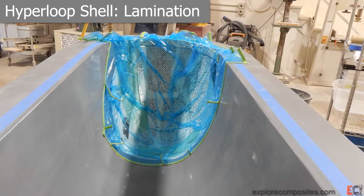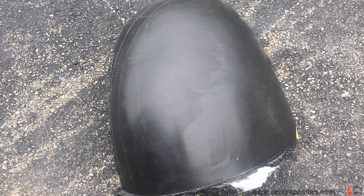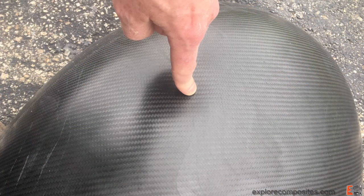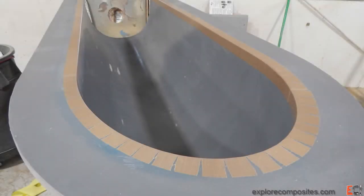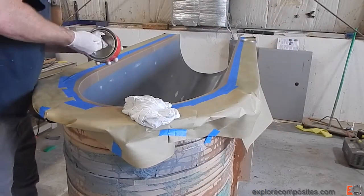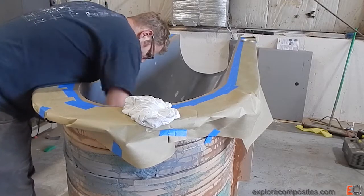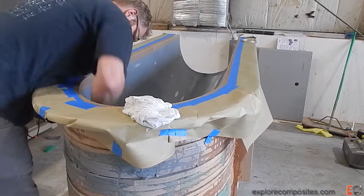Before laying up the part, I made a sample of the laminate just in the nose to get a sense of how stiff the compound curves would make two layers of 200 gram carbon. I thought maybe stiff enough. I put a little bit of Teflon around that corner. I wished we had enough Teflon to do the whole thing, but I didn't and didn't have the time to wait to order more, so that's why we're using wax here. Surface finish would have been a lot nicer and there would have been fewer pinholes if I'd managed to have enough Teflon on hand.